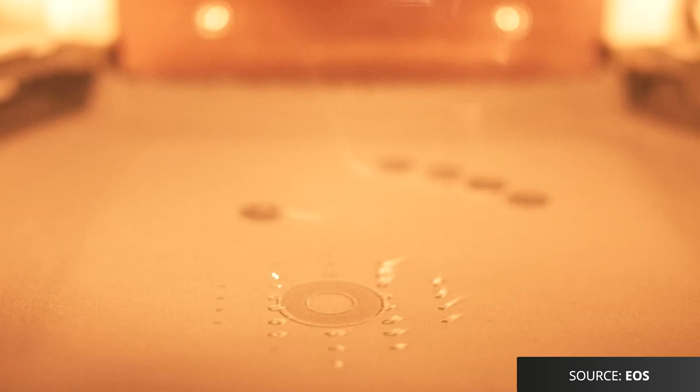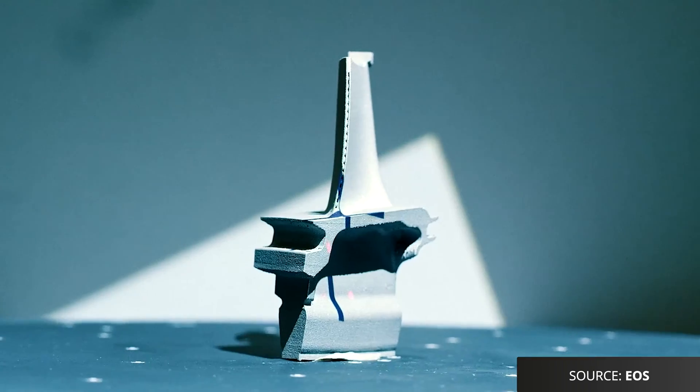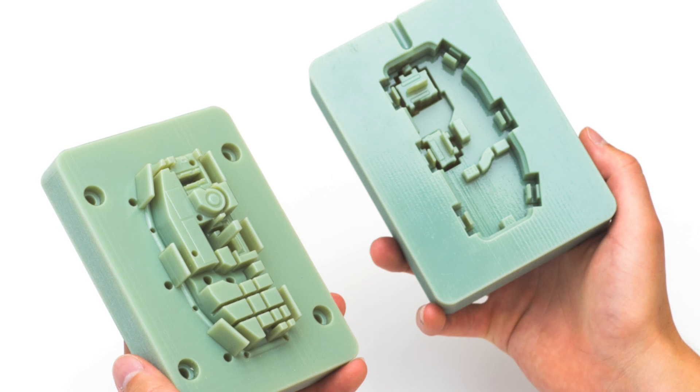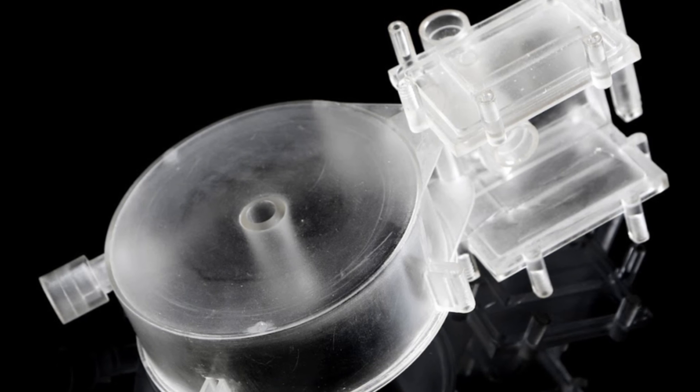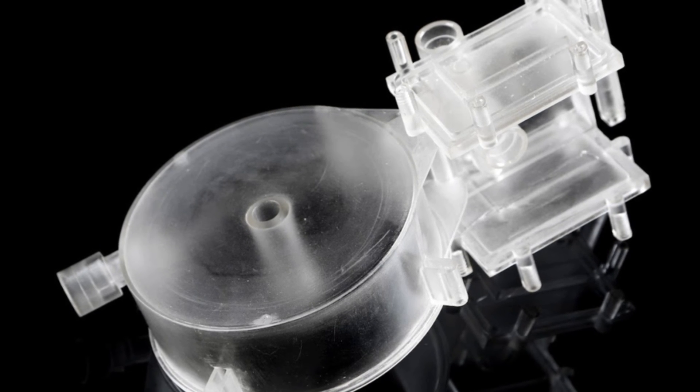For more information on designing parts for SLS, there are handy guides and links in the description. As discussed earlier, each time an SLS printer wants to produce a part, it has to utilise the entire volume of the print bin. One advantage of this is that multiple parts can be manufactured in a single build, offering viable economies of scale at certain build sizes. A good rule of thumb is that if parts are smaller than a fist, they could be ideal for SLS batch manufacturing. While SLS is not going to compete with injection moulding any time soon, it does offer some key advantages for lower production runs. A die is not required, and this is often a large part of the cost associated with injection moulding. Also, the parts do not require draft angles or any of the other design constraints imposed by injection moulding, and SLS parts are comparatively strong and functional. For this reason, it can be a viable option for smaller parts that require production runs of 500 to 1000.